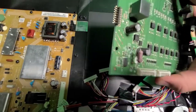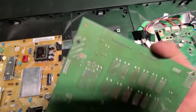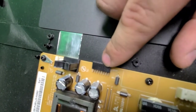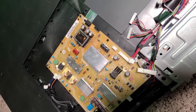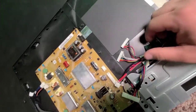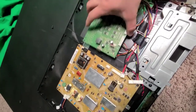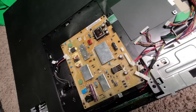They say these 16-pin connectors aren't soldered very well. I pulled this out to check — they're soldered pretty solid, I can't move them. But this pin right here is supposed to be soldered and I'm not using any pressure. We're going to flip this board over, look at the solder joints, and re-solder them. This just shows how cheap TVs are made — they plugged the boards together to make it more compact with less cables, which isn't a bad idea, but they use cheap solder and Vizios are horrible about this.